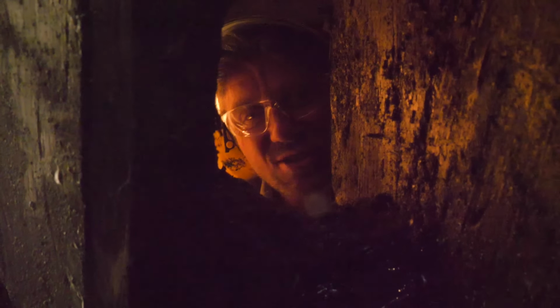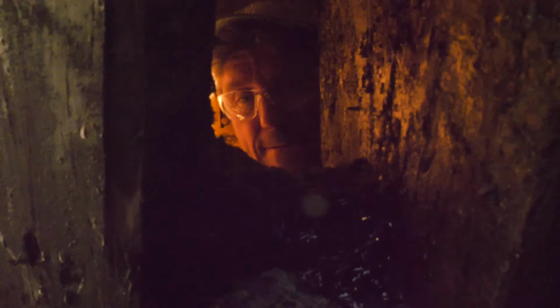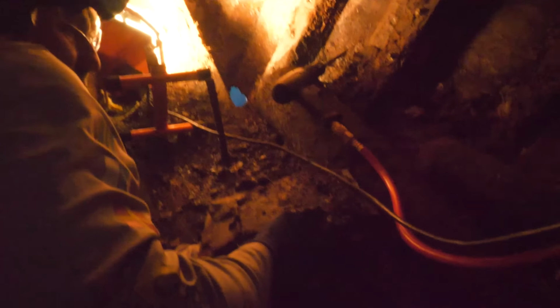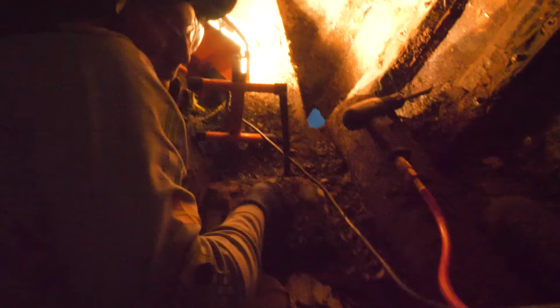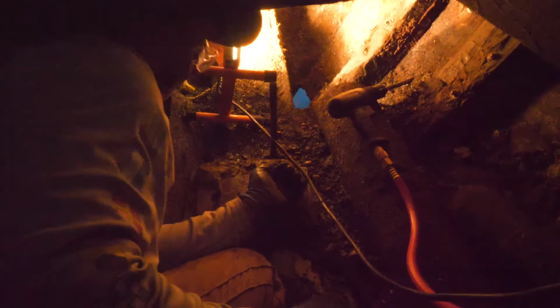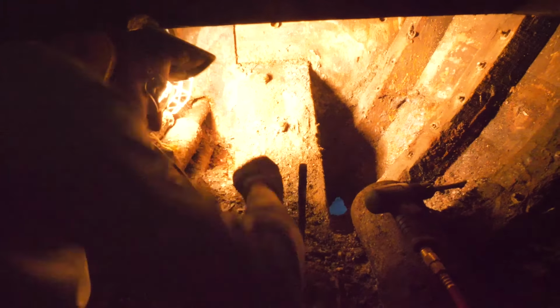I'm chiseling the cement ballast out of this bilge. It's probably one of the most confined spaces on the vessel. It's really fun in here. Sweet. Yeah, so this is what we're doing. We've got old ingots. Just chiseled one of those out. And we've got chunks of railroad tie plates. And I don't know what this is. It appears to be solid steel rod, about 7 inches in diameter. This is our stem here, where it starts to meet the keel.